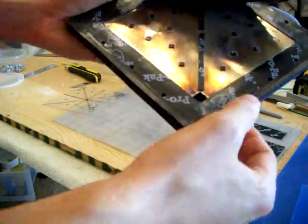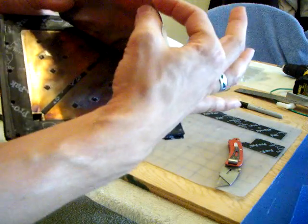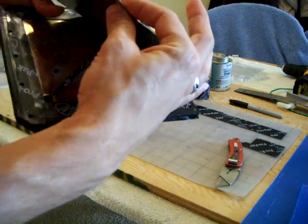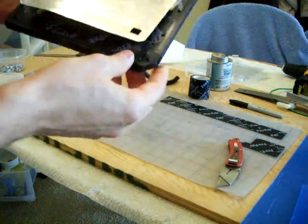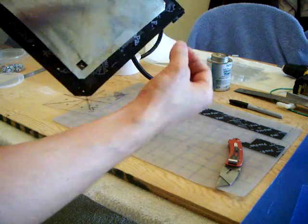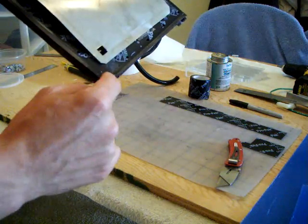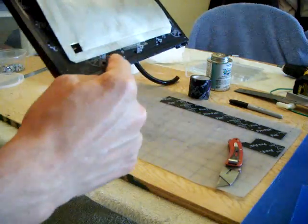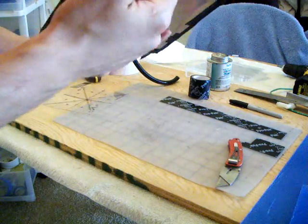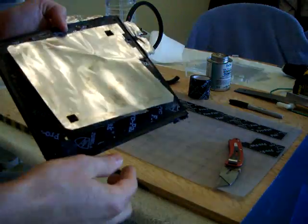So this is how I made it, to make sure that I compensate for the thickness of the foil, which is 0.002 of an inch. It doesn't go to the end, so obviously here it's thicker than here. So I calculated how many I needed, and I found out that two layers of electric tape placed all around here compensated for the thickness of that. So two layers here, two layers here, and now everything is even. Put my plate, tighten my bolts, nothing was leaking.